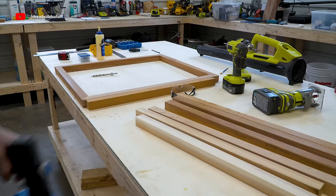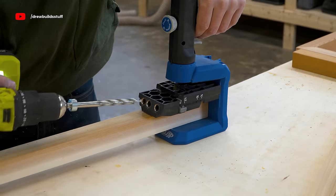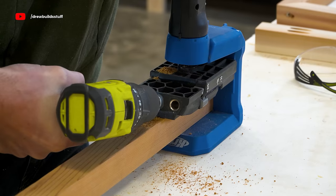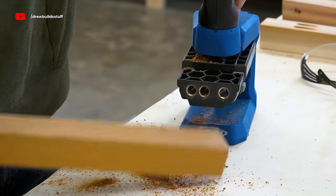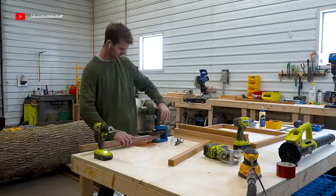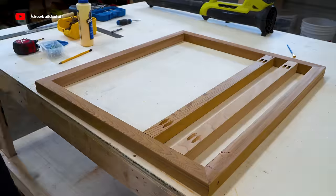To assemble these pieces I'm screwing them in using pocket holes. I have a handy little clamp-down jig that makes drilling pocket holes super quick and easy — I just clamp it on the end of the piece and using the provided drill bit and two hole templates I drill in two pocket holes, easy as that. I did this to both ends of all the pieces, then marked out even spacing and started screwing them into place.